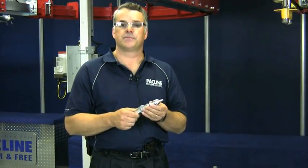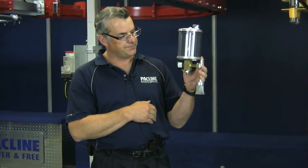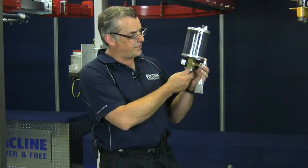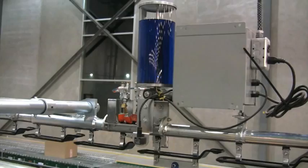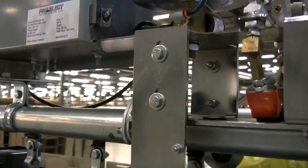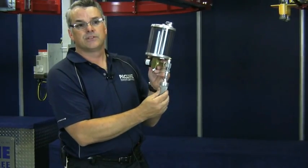So we want to make sure that your system gets adequate lubrication. Each system that we sell comes with some form of a lubricator. I have our model 375 lubricator here — it's a brush style lubricator. The lubricant is put in this reservoir on the top. And when we tell it to, by opening a switch, a solenoid operated device here, oil will flow down into this brush. This chain is being pulled through and under this brush, so lubricant gets transferred onto the bearings and chain linkages that way.